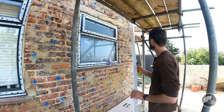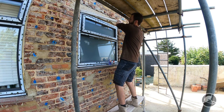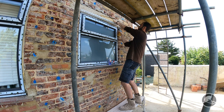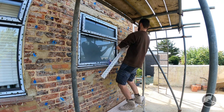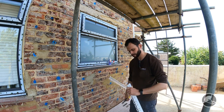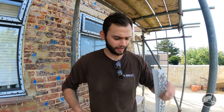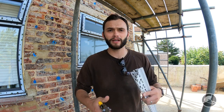To get the size it's very much similar to a skimming bead — just offer it up on one side. You have to remember it's a 15mm bead, so you want to cut it about 20mm short of the other side of the reveal. Then just trim out the wings a little bit — when you're pushing it into the window, it just makes life an awful lot easier.